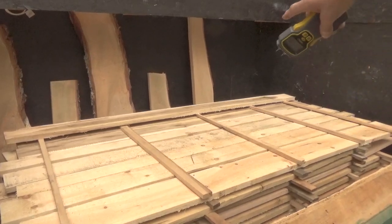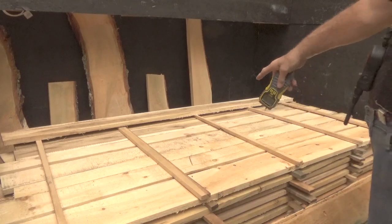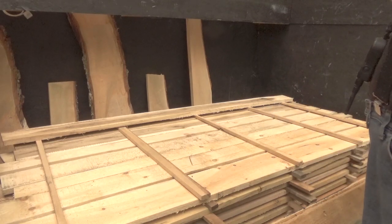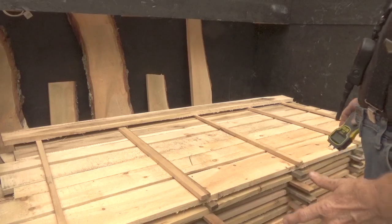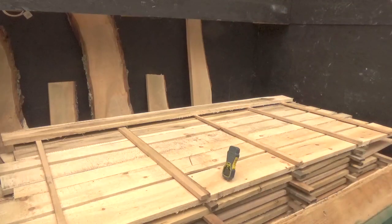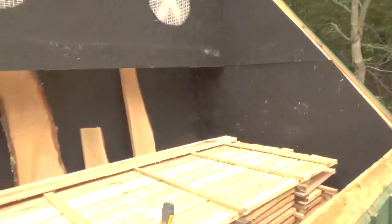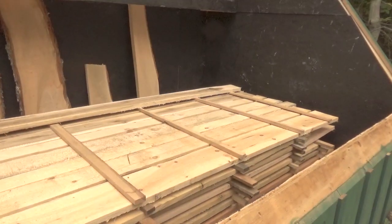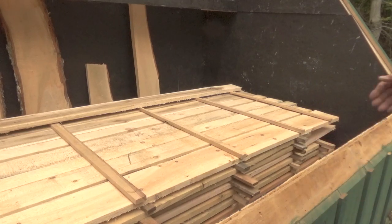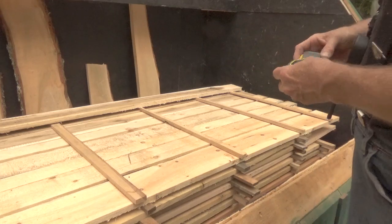The boards in the back of this is the maple I just took off. What I want to do is, this pine that's here, I had it put in here the day before yesterday, so you're looking at not quite 3 days in the kiln. And the wood is already down to 14%, because the relative humidity is good. It's almost 40, down to 40, and the temperatures are warm. Now having this board out on the edge like this is probably helping it to get a lot drier quicker than some of the other ones.